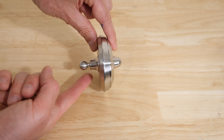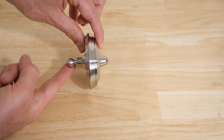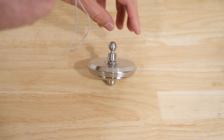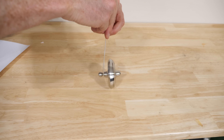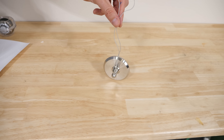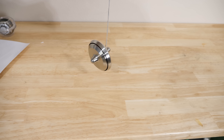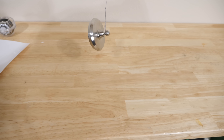For example, let's say you have the gyroscope like this and I push up on this lever — you'd expect it to just fall over. When it's not spinning, that's exactly what happens. Or I could have a string on it and lift up, and it falls over like that. But that's not what happens when it's spinning. Now I lift up on it, and instead of tipping over, it just starts spinning around in a circle. If I let go it stops, but if I put some force on it, it spins in a circle. I can even lift it off the ground and it still doesn't tip over — it just spins in a circle. When a gyroscope does that — spins in a circle when you apply a force — it's called precession.